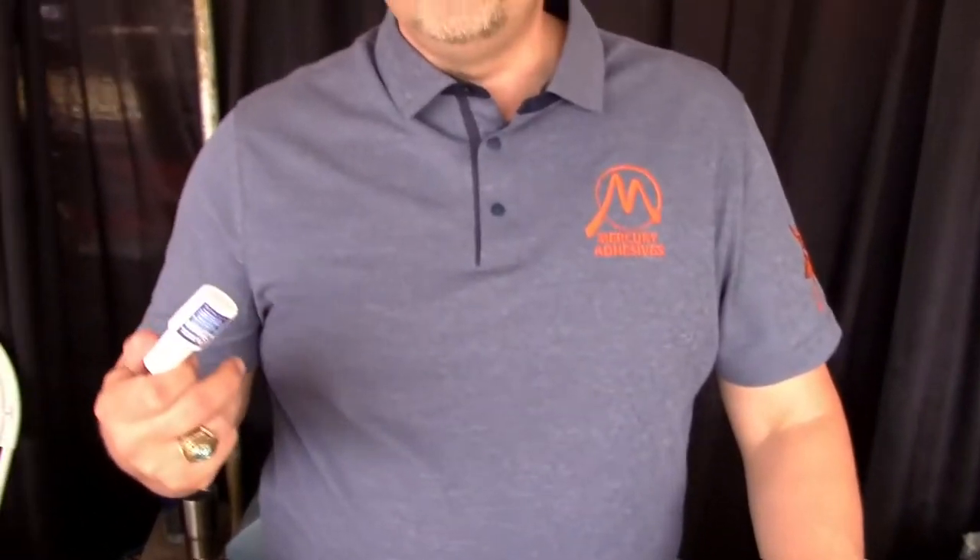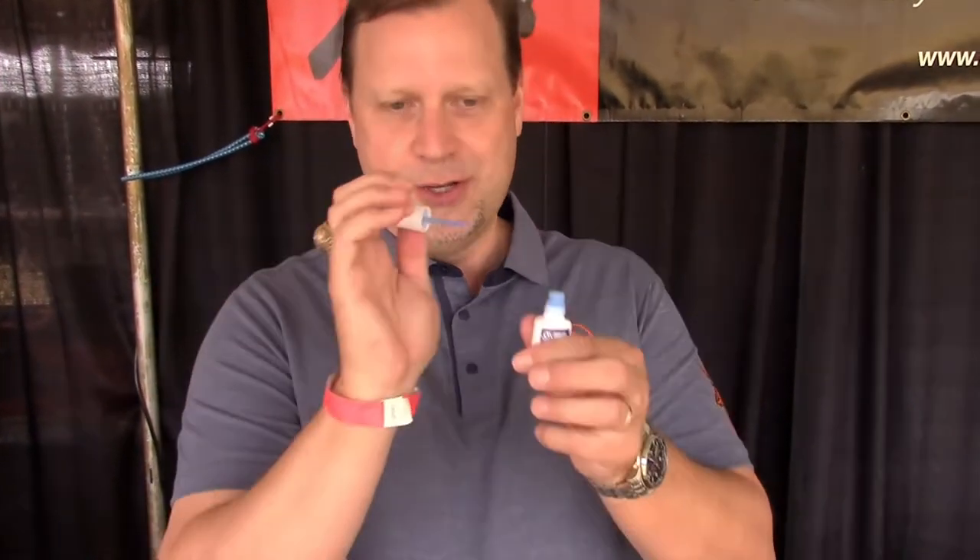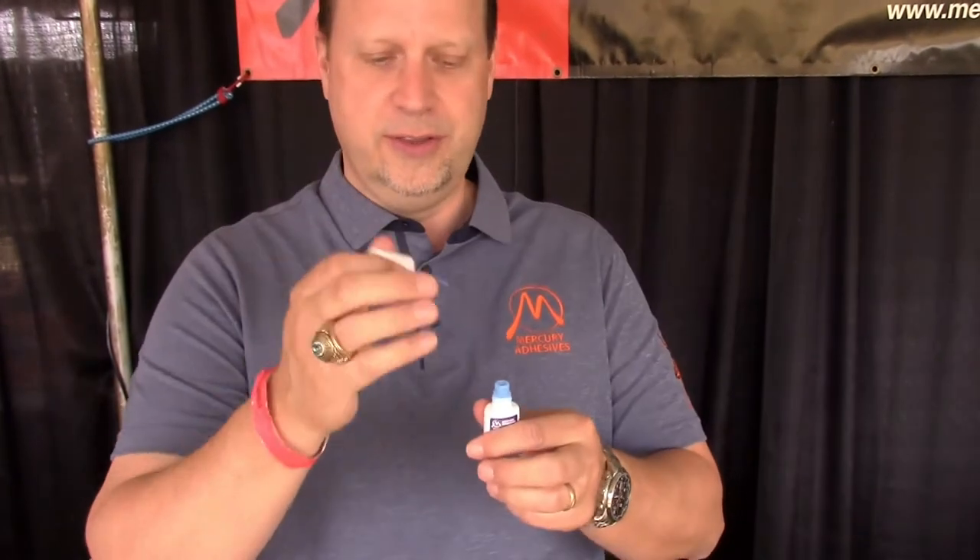And now here's Eric Feathers to talk about it himself. For anybody that uses Loctite or thread locker and has made a mess, here's something you ought to look for: a brush-in-cap thread locker. Just run along the grooves of your fine screws — won't make a mess, it won't leak into your motor mount, it won't leak into your windings.